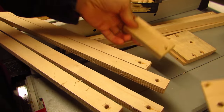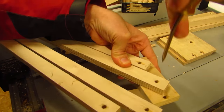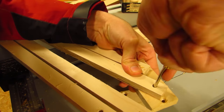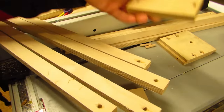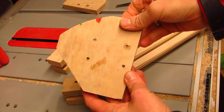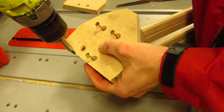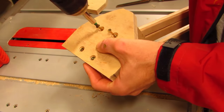For the ends of the arm, I used the same hole distance in two pieces of plywood each. Bolts come in handy to hold things together and to set the arm in such a way that you can move it but it holds position otherwise. Depending on the load, you can also open the joint, move it, and then fasten it again.